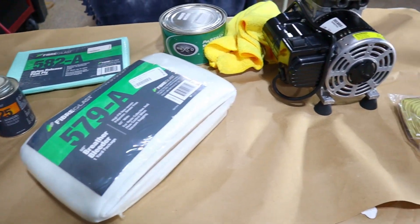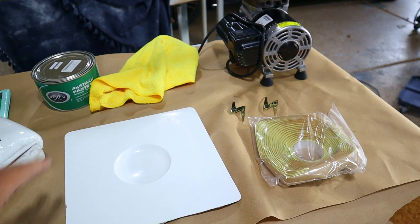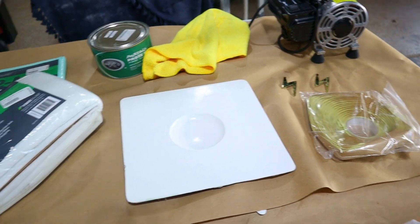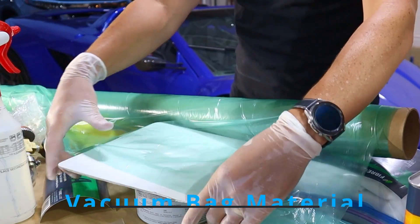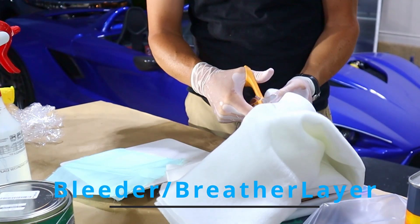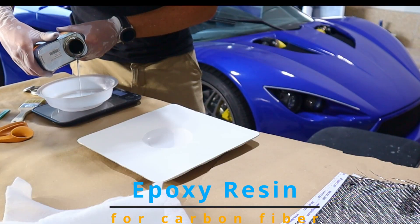Here are the materials we're going to use for the vacuum bagging process. Here's the plan: I'm going to go ahead and make my vacuum bag so that everything can just be placed into the vacuum bag. I'll get my vacuum connector and everything all set up so that when I do the wet layup, I can just slide this in and turn the vacuum on. I'll wax this a first couple of times, make the vacuum bag with gum tape, and get the peel ply, breather, and everything all ready. So let's go ahead and do it.